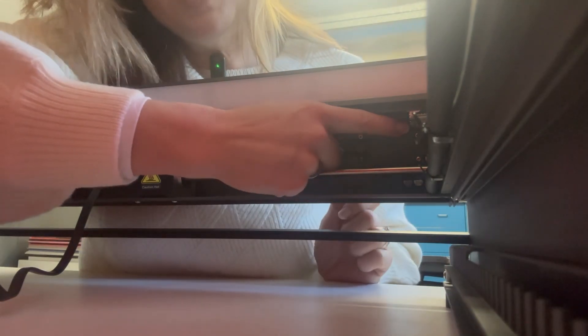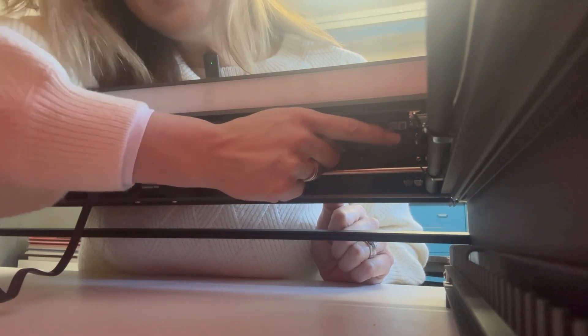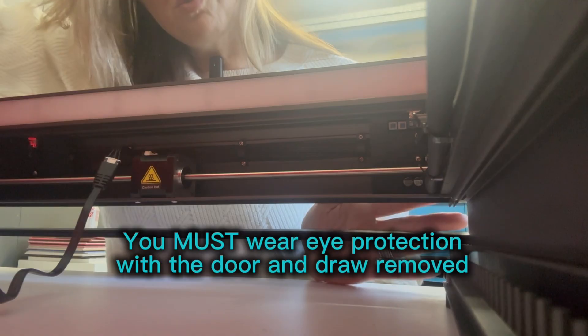On the very left side here there are two little buttons: one is to disable the front lid of the machine, and the other is to disable the sensor for removing the tray at the bottom. Push both of those buttons in. You are disabling a safety feature of the machine, so after you've finished using the rotary I very much suggest that you turn those straight back on, because there's a reason we have those safety switches. This means that once your rotary is set up, you can use the laser without the door alarm going off or the drawer-open alert triggering.